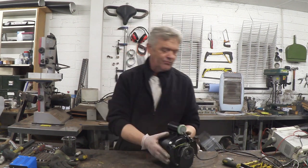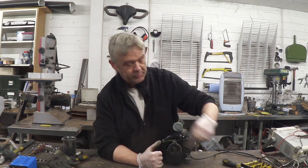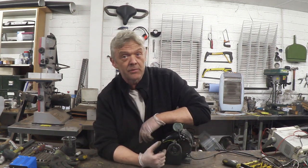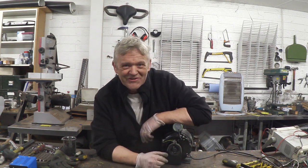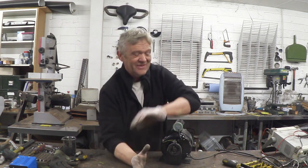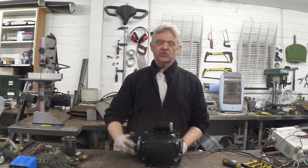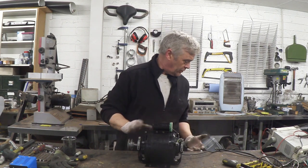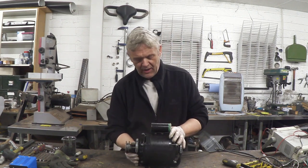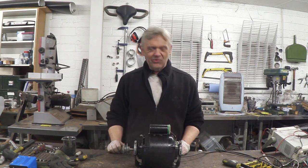It is an old motor and there's a thing I'd like to point out. I've removed this cover plate because these don't actually have bearings in them — they've got bushings. The bushings have a couple of felts in there. You have to remember to oil those felts or the thing won't turn. When we got it out of the potter's wheel it wasn't turning either. Now it's nice and turning freely. I've replaced a couple of the cables incidentally, and that's the motor ready to go.